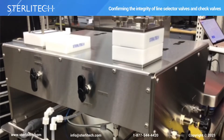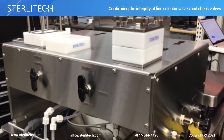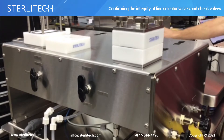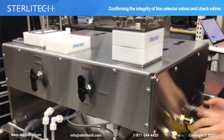In this video we're going to check our ball valves, our line selector valves, as well as our check valves. We'll start by running at a low flow, so I'm going to set it to 20% — this is a 1.8 GPM pump, so 20% of that — and we're going to verify that we have all lines open.